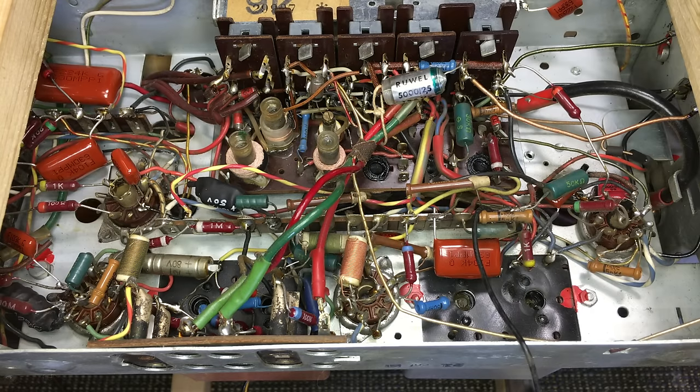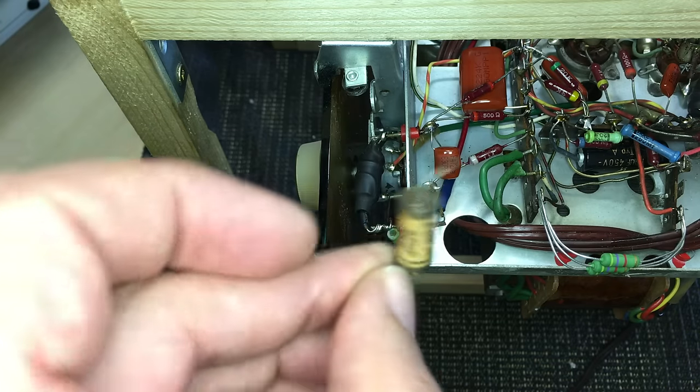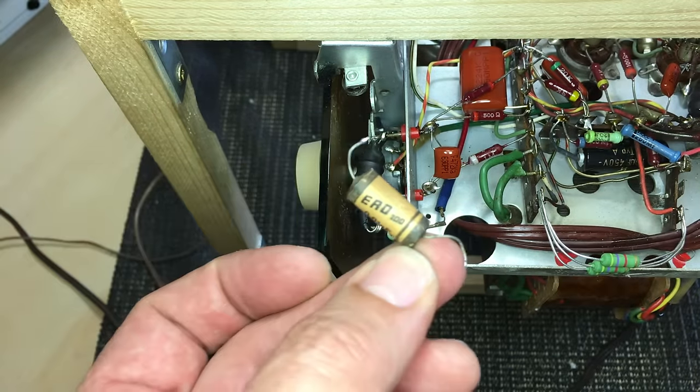The reason for all this work is twofold: one, it was convenient to do a lot of it before even powering up. And I don't want to go any further without powering it up, because there's nothing that creates more anxiety than knowing you're working on something and it might not switch on. Just before I do that, there's something I want to show you: this is a 10 nanofarad 250 volt cap - one of the capacitors you swap practically always - but it has an extra lead.